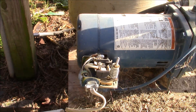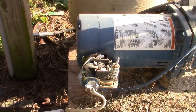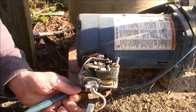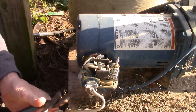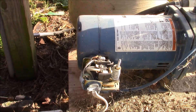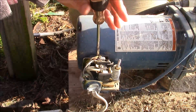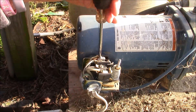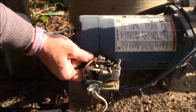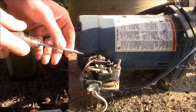Tools I'm thinking we're gonna need today is a flat tip screwdriver and adjustable wrenches. Up under the bottom of this is a fitting for the pressure switch — what it does is this tube lets it know how much pressure it's got. This pressure switch I got is 20 to 40 PSI, depending upon the size of your pump and all that other stuff.